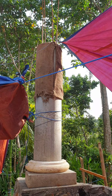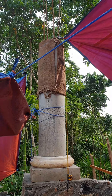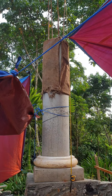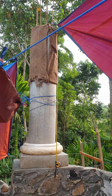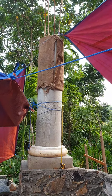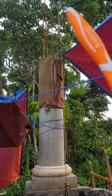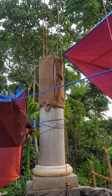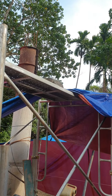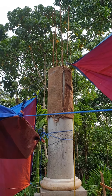With that 33 centimeters deducted, we still need to make the concrete higher to reach 3 meters 17. I've managed to place the metal tape measure on the side of the column — it stays up. We still need 3 meters 17 from this level up to there, so we need to mold one more section with the metal formwork you can see over there.